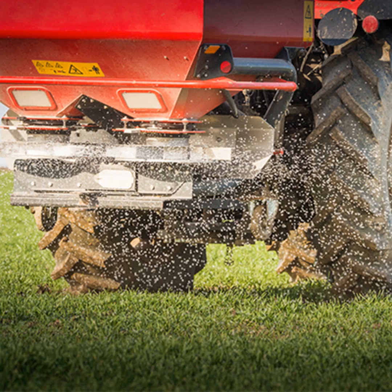The most accurate way to check your spread pattern is a tray test. You lay out a set of trays across the working width, do three runs — one up, one down, one back up — and you should have an even amount in all the trays. Trays are available and not overly expensive, but I've met farmers who've used biscuit tins with egg boxes inside — absolutely fine, you're just collecting material to check for even distribution across the working width. For contractors, we're pushing regular tray tests. For a farmer, once a year per product would be more than enough.